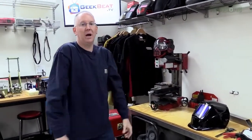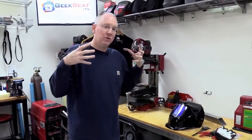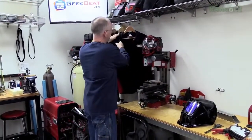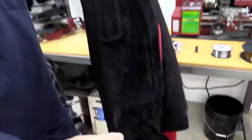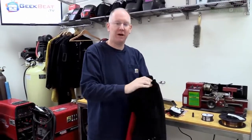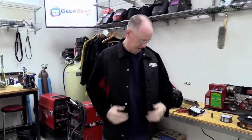Let's talk about a jacket, because you get radiation coming out of the material you're welding and that will give you sunburn — weld burn all over your arms, chest, and neck. So we have to wear a jacket with long sleeves. This one from Lincoln Electric is nice because it has two different types of material: the sleeves are leather, so when you're working close to the material and things are splattering it's much tougher. The back and front is cotton, which means it's lighter and cooler in a warm environment. It's a good-looking jacket that fits nicely.